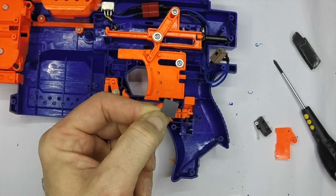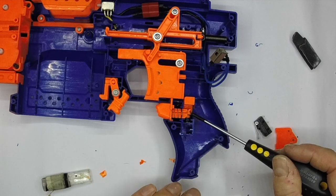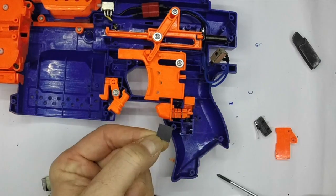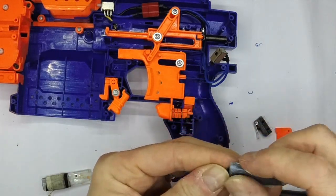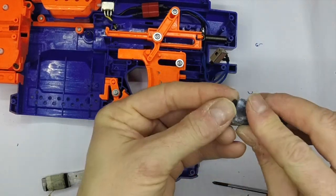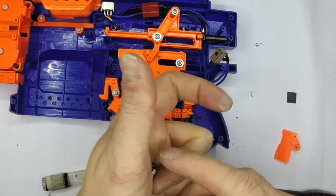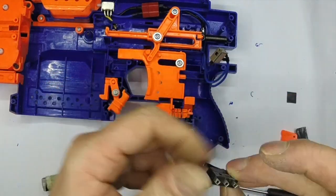Here's the little tiny bit of plastic that I've just made up to go across here. I realized I'd gone a little bit too far down with that and the arm was then going to catch on the lock. If you're removing this lock that doesn't matter, but I really want this lock to work. I've got a little plastic spacer here - this is 0.5 millimeter styrene sheet. Whenever you glue anything, even if it is Devcon, just roughen the surfaces a little bit with emery cloth or a file, because it just helps the glue bond and gives it greater surface area to tack to.